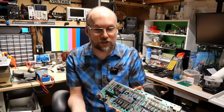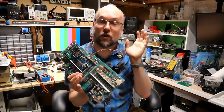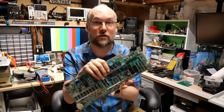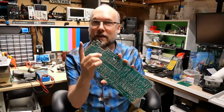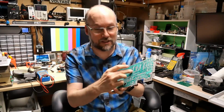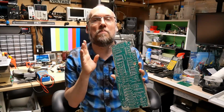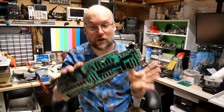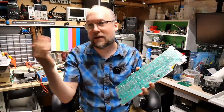And of course, I made a fatal decision of bridging the 12 volts onto that one data line, which had the effect of killing this ROM chip and killing this latch here. So with the Ti99, if you ever do any repairs, well, this probably goes for any time you reinstall sockets onto a board, it's a good idea to use something to inspect your work closely afterwards. And I can say I will be doing that from now on with all the boards I work on, especially ones like this that don't have solder mask right there. But it could happen even on, say, a Commodore 64.